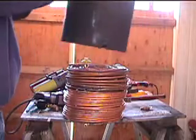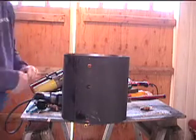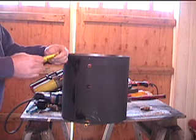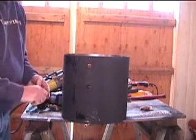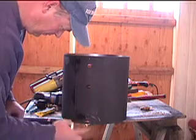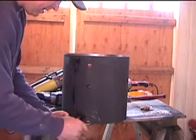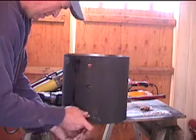We're going to try to fit the sheet metal shroud. I'm going to put a little pipe sealant compound — I use this one, it's good for gas or water up to 100 psi and it dries pretty hard and stiff. Just put a little of that on these threads. Follow the instructions — I haven't had any problem with this stuff, it's been great. You're just going to go a quarter turn past tight, and you can disassemble things later if you want. This works real well.